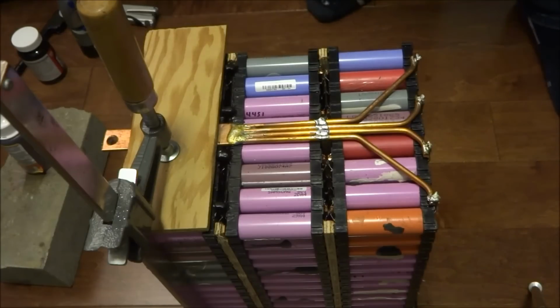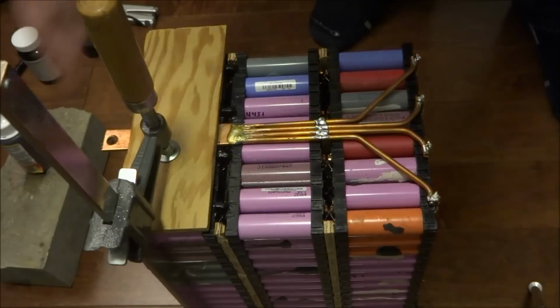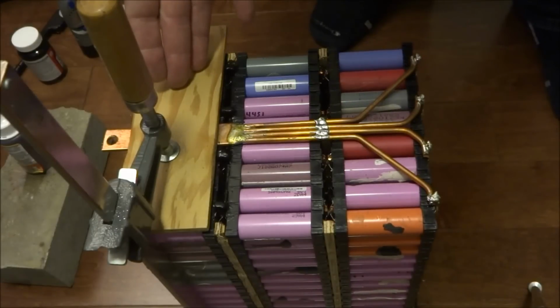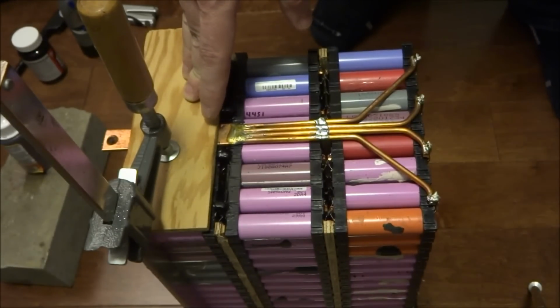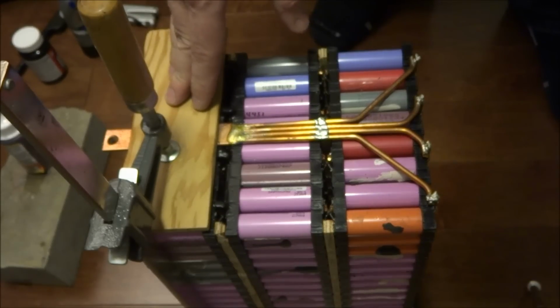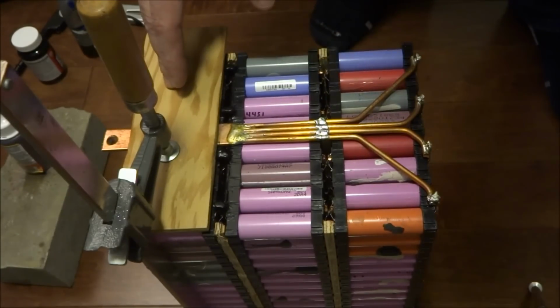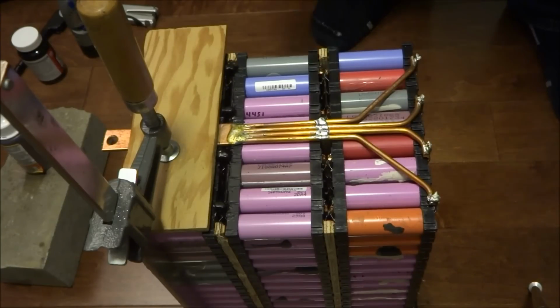So I guess technically this battery is functional here. I got both positive and negative terminals connected, so it could be used as it is, but I think what I want to do is put some balance leads on it. So I guess that's the next step. I'm going to put balance leads to be able to verify that every group of cells is balanced one to the other. So let's let that set, and we'll move on to the next part in the next video.